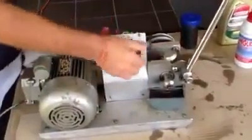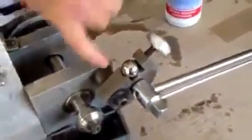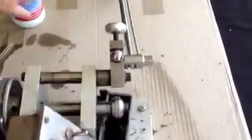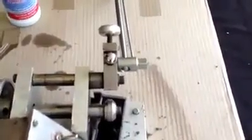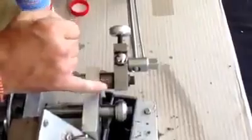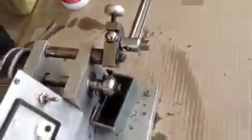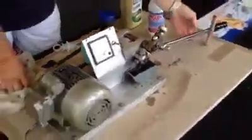Alright, seriously please, you can see what it's done to that bearing. If you look at the nature of the wear, it's dull and it's got striations on it that have been ground into it by the metal pickup, that rotating bearing. Now, I'm going to lubricate this. Bit of Uniglide on my fingertip. Let's put some on this bearing. It's going to be hot. Not much. No, there's not much there at all. I thought it was just a smear on my fingertip.